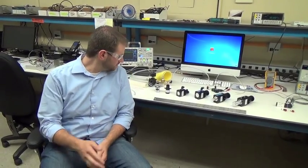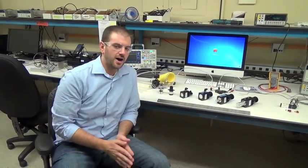My name is Tom Kieser, mechanical engineer with Acro Associates. I'm here to give you a brief introduction to the pneumatic pinch valve product line offered by Acro Associates. As you can see behind me, we have six pinch valves on the table, ranging from our 932 up to our 935 high force. Each valve was designed to work with a specific range of tubing sizes, ranging from 1/8 inch for our 932 up to 1.6 inches OD for our 936.